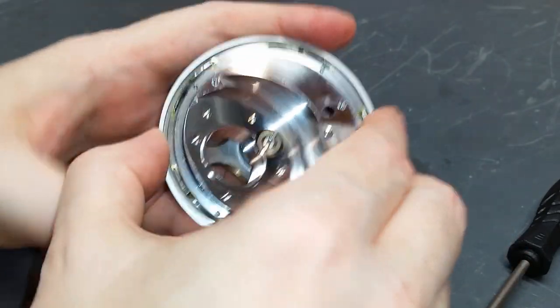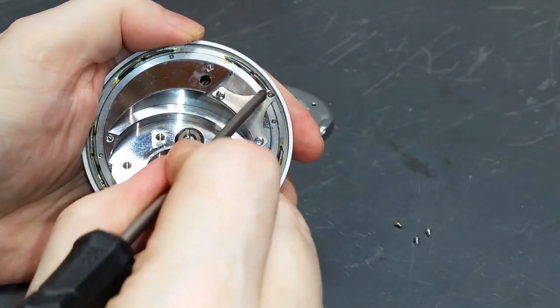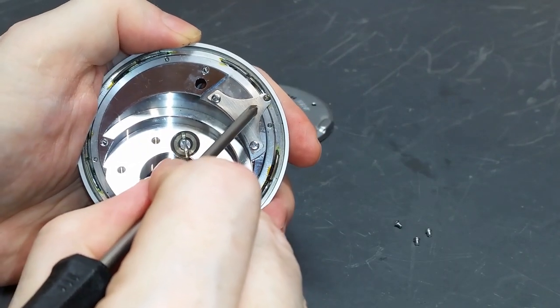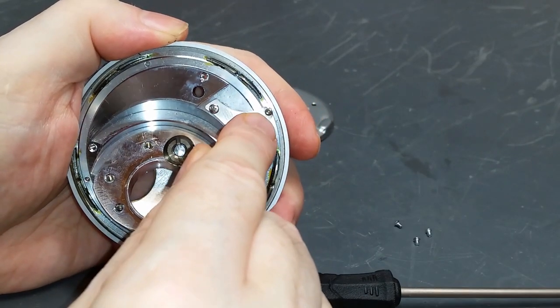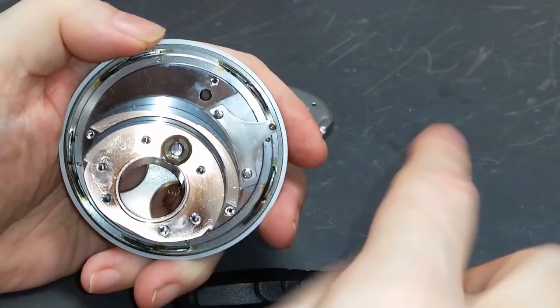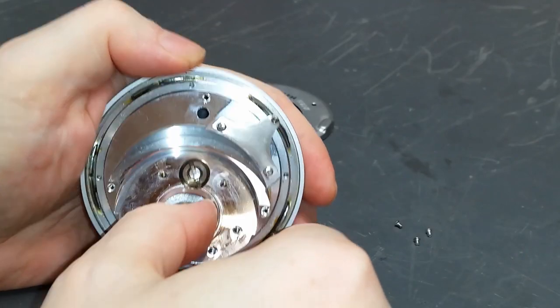This is what's under the cover. There's a metal piece held on with two small JIS screws — this is the detent, this is the ball for the detent mechanism. As the thing rotates around, the ball that's welded onto this metal piece drops into these little V-notches, and that's what causes your detents.